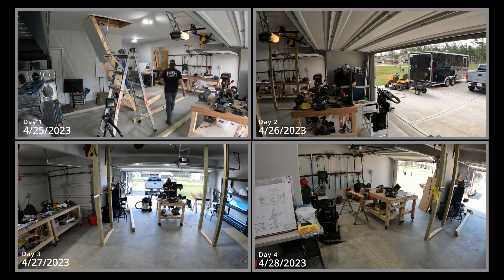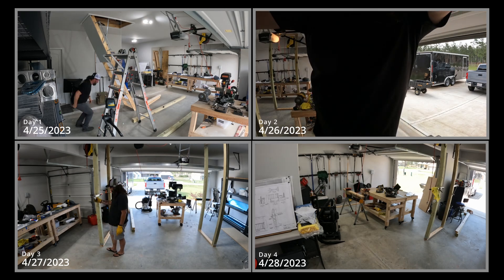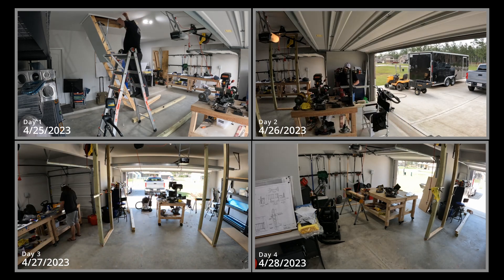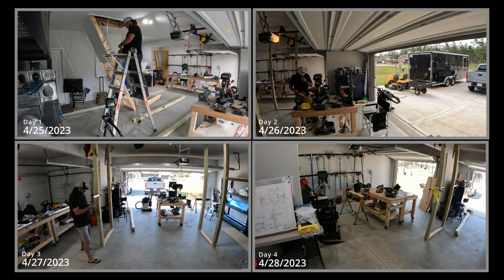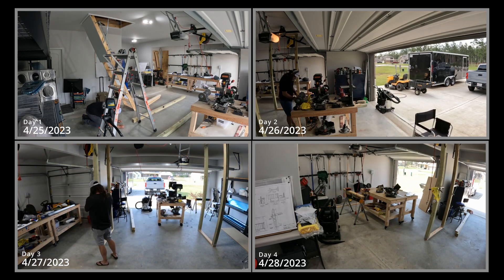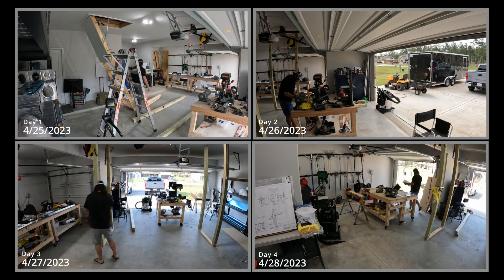I feel confident I'll be pretty happy with it when I get to hanging the wing spars on there, which is coming up in just the next few days. Today is the 11th of May as I'm recording this. I've completed pretty much all the prep work on the front and rear spars for the wings, and now I'll be getting into wing rib prep — a lot of ribs that need flanges straightened, fluted, edge finished, deburred, primed, and so on. That'll take a few days probably.